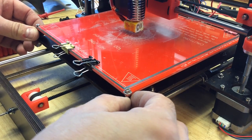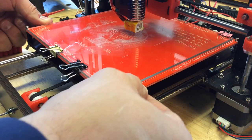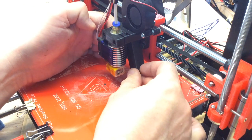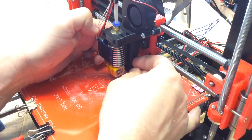The next step was to print the cooling duct. I printed it on this machine without a fan and ended up with two pieces — the first one was too short, the second replacement was long enough for the E3D V5. I actually used Tinkercad to stretch it out, and once I printed it, it fit perfectly in place — just a press fit. There are mounting tabs for screws, but I didn't even use them. It fits perfectly.